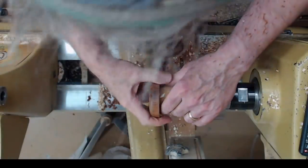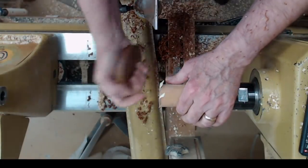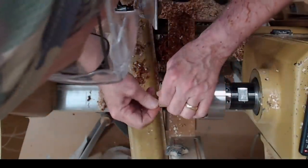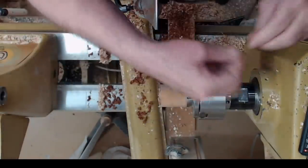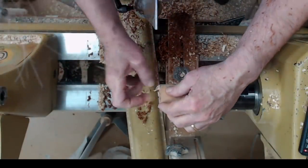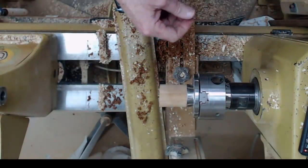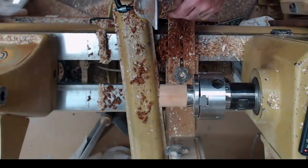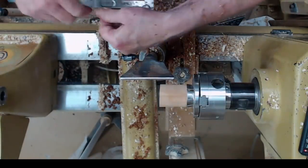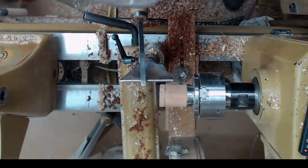Now using this same scrap to show you how strong the tape is — we're going to pull, and that's on end grain, side grain — and it just held it very strongly. I should have gone ahead and sanded that, but I can hand sand it. It's got pretty smooth cuts and that's going to be on the bottom anyway. You don't have to sand much past 320 — this is almost like a piece of furniture, not fine art, and it's going to get rough use. I'm going to mark the half-inch deep, three-quarter-inch tenon and cut it using that eight-millimeter beading and parting tool.